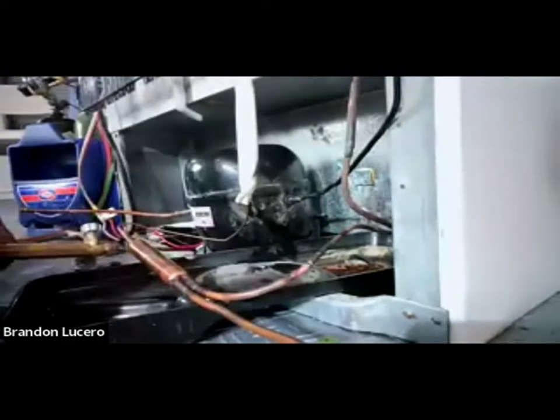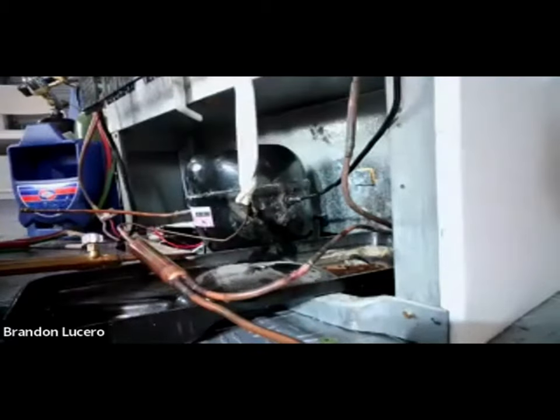She went in substantially. I see why this happened - I can tell that this compressor wasn't the OEM or original. The diameter is a lot larger on the compressor than it is on the diameter of the condenser line. That's probably what led to all that excess solder. The more ideal thing would have been to put a one-quarter adapter and make this go into the quarter, or pinch here.